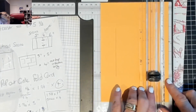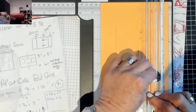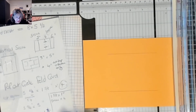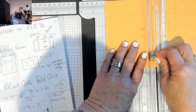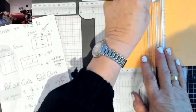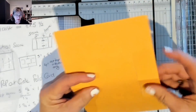At four and a quarter you will be at the six-inch mark again, and that line is lining up with my score line. Take that back up to the two. Now remove your blade and go to the four-inch mark - we are going to score up to the cut line, lift it up, go to one and a quarter, and score there. So now you've got a score here and a score here.